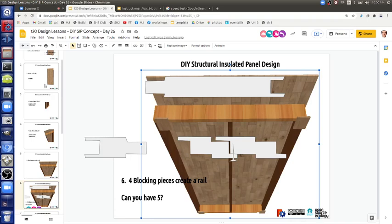I think you're talking about, I don't know if pipe clamps like that bow in the outward and inward direction, aligning that. The easiest thing is a block, which sucks it in. So if you attach the block to one, then when you screw it in, each screw has 300 pounds of force for a regular 1/8 inch screw, like 3 inch long. Bigger screws will have a little more.